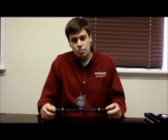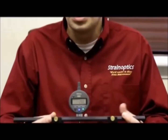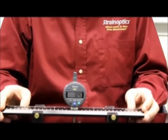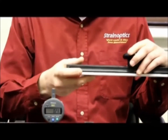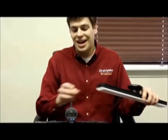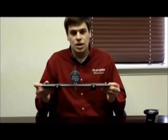Another benefit of the three-point contact gauge is that we have these adjustable contact feet that we can move to the average wavelength of the roller wave. This allows us more accurate peak-to-valley measurements, where the flat bottom gauge typically just rides on top of the peaks and measures into the valleys. Our three-point contact gauge measures both the peaks and the valleys to great accuracy.